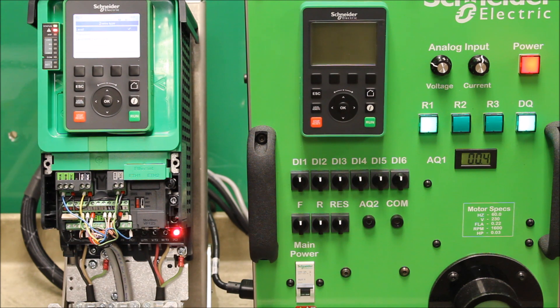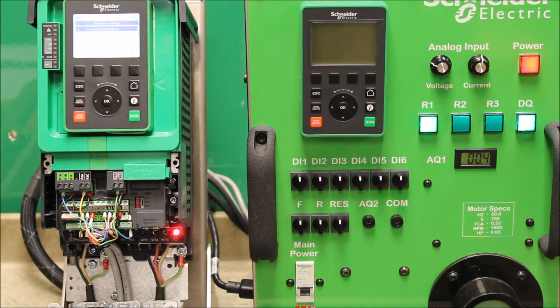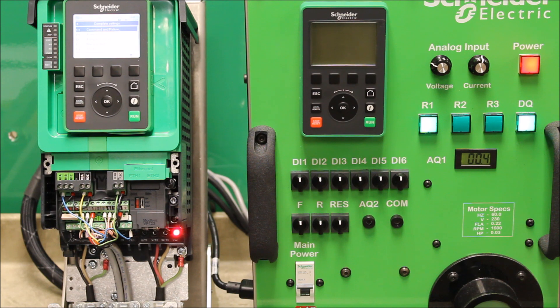So, 2-wire type set to Level — that's it for the programming, just those two parameters. One more important note: for automatic restart to fully work, the actual fault condition has to go away. The fault code has to be clearable by the drive. Not every fault can be cleared automatically — for example, a short circuit cannot. There's a list in the back of the manual. The fault condition, like a power outage, has to go away for the drive to restart on its own.